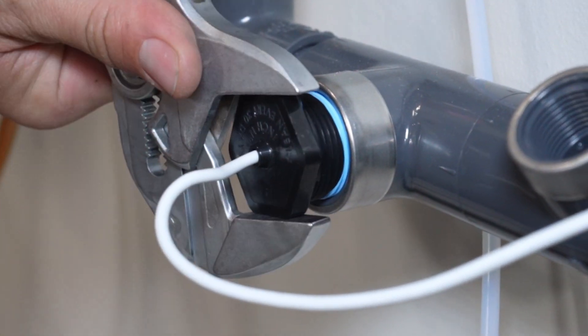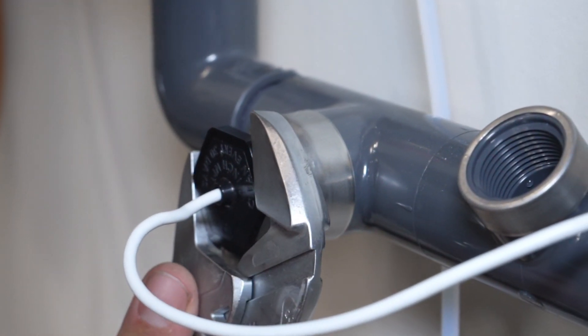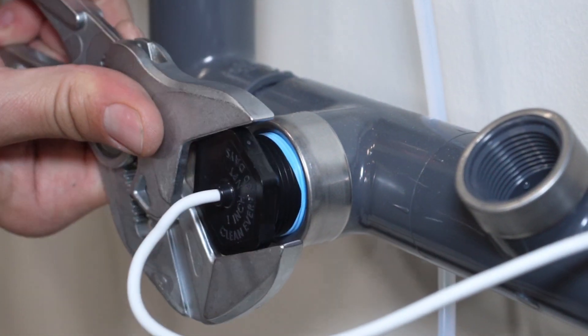The EC probe does not detach from the monitor. I like to pre-twist the wire four to five times in a counterclockwise direction before installing, so that when we are tightening the probe into the monitoring loop, it does not leave the wire twisted up when finished. This results in a cleaner installation.